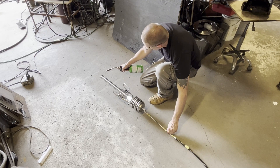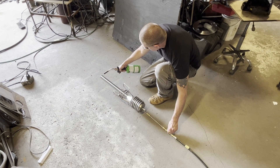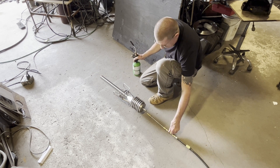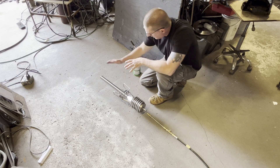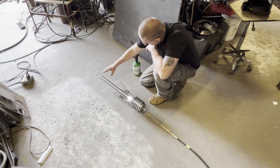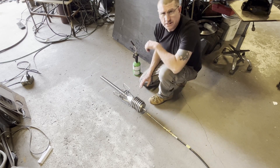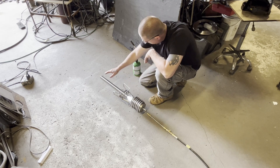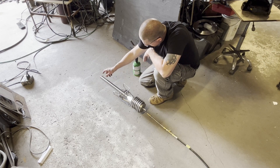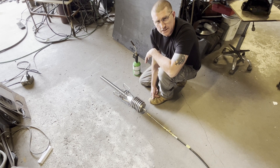We're going to start off — and it's just as easy as that. So you're lighting it as the burner is being turned down. The discharge velocity when you have the Venturi nozzles on is quite high — it's like five times the speed of the combustion velocity of propane. So what we do is turn it down until the combustion velocity exceeds the discharge velocity, and the flame will enter into the burner and initiate the oscillations.